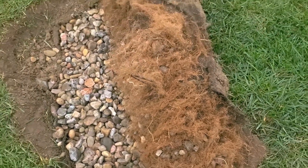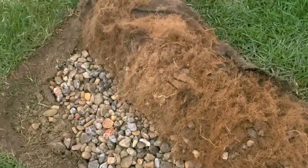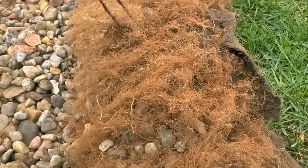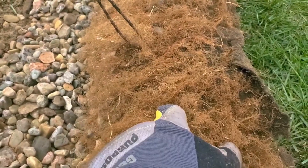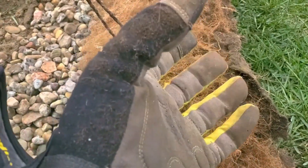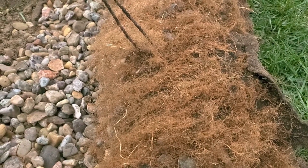The roots aren't really developed right now like they will be in another month. It's early spring, the grass is waking up — it's pretty dormant really, and we don't even have a lot of color. But the reason why our fabric drains so well, and it works better and better over time, is the development of roots growing through our double-punched fabric with two different size holes, so that you can get those little roots in there that are a thread, and they expand and keep that punched hole in the fabric open so that water is free to flow down it.